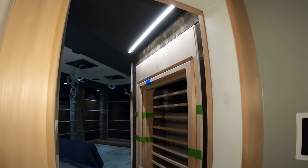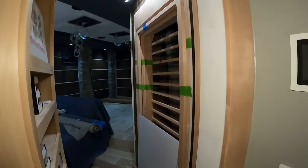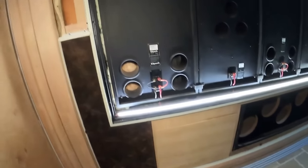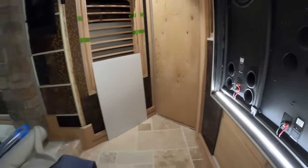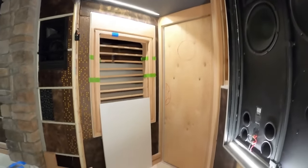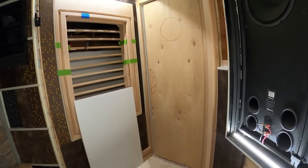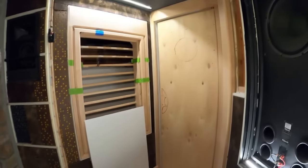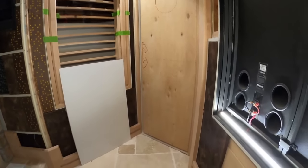And then all the millwork is cut and glued, and we'll do our finished sand. Everything's going to be stained walnut. Go back in here. So millwork's done around the door. Porthole window's going away. The film reel's going away. That's just going to be a piece of walnut on top of that that's stained, or alder that's stained. This is all alder. And then we're going to do almost a floor-to-ceiling door handle, door pull.